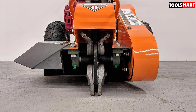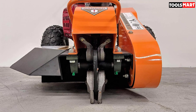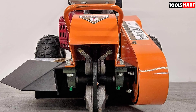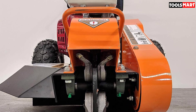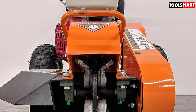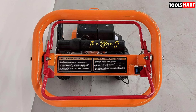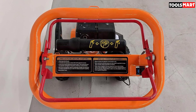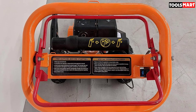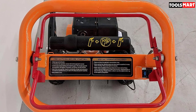It uses a reliable Honda engine that lets it seamlessly cut as deep as 12 inches into the ground. This power is channeled through a unique cutting system featuring four rows of a total of eight tungsten blades for turning stumps to dust. The STG13 is also easy to handle and lightweight, weighing only 115 kilograms — impressive for a powerful stump grinder. Coupled with its four-height adjustable handle, working with it is comfortable and unstressful compared to most stump grinders.